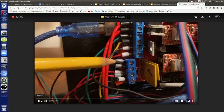That feeds what you see above there, that's the actual heat bed. So the power to here is what comes out of that as a trigger. That's the power feed to the heat bed. I don't know if that makes sense, but that's 5 volts. We're feeding the solid state relay with 5 volts. It's a signal.